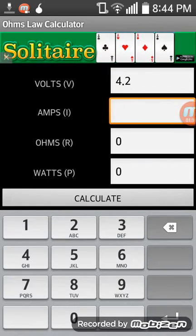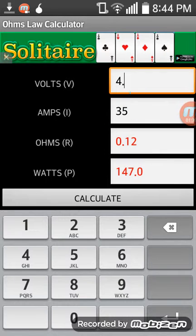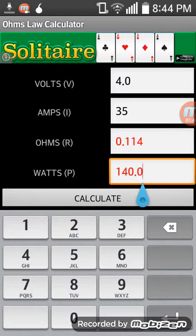So, if you have a fully charged battery, right? And let's say you have a 35 amp battery. Let's say EFEST, if EFEST is truly correct with their amps, it'd be 35 amps. You could build down to 0.12 safely, if that's correct. Now, as this goes down, of course, these values are going to change. You're going to get less and less with each vape. So, it'll be safer still.